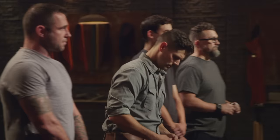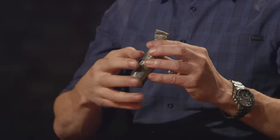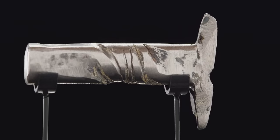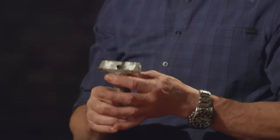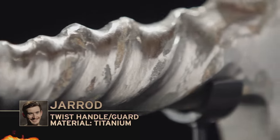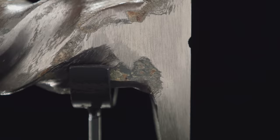Colin, please present your handle to the judges. You got a hole in there finally — it's not super deep, about that deep from my eye, but nice job with that. The twist is visible, but it has a lot of sharp fissures in there. The guard has a longer side and a shorter side to it. If you move forward, there's some cleanup that's going to need to happen. But it was great to see that you were able to ditch the first 30 minutes and still catch up and put in something very handily. Jared, you're up. I think you really nailed it — it really fits well in the hand, it's quite symmetrical. In your guard, where the handle meets my finger, a little bit of rough edges, but it's a very interesting fit that feels really good. Great job.